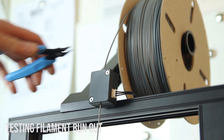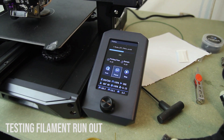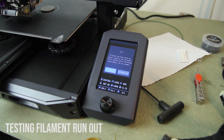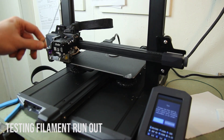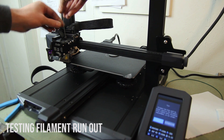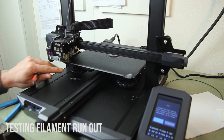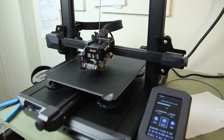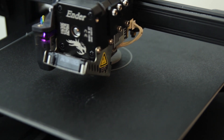About the printing — I did a little test run to see how the printer reacts when you run out of filament. The printer will ask you if you want to continue or stop the print. You'll be able to change your spool and reload the filament into the extruder, then continue printing. There are some little downsides: it's a little bit under-extruded in the beginning, but then it starts printing again — it's a way to save your print.